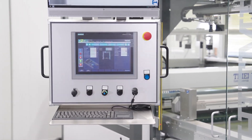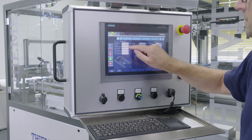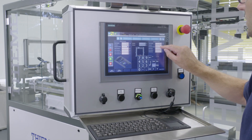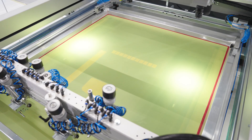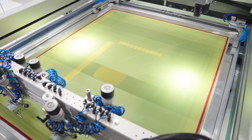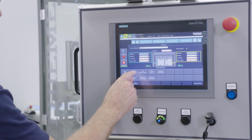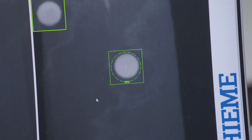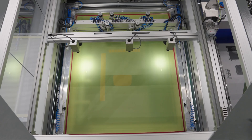As a new feature, the peel-off can start separately from the squeegee movement and the maximum available peel-off per squeegee distance is automatically calculated and programmed. In standard configuration, the machine is also equipped with the well-known TEMA Vision screen alignment system with two alignment cameras, using two fiducials in the screen to align the screen within 40 microns. The fiducials are part of the exposed image in the screen outside the printing area.